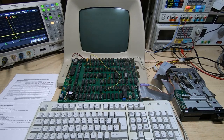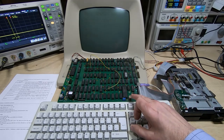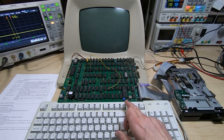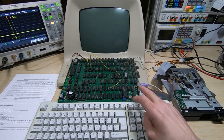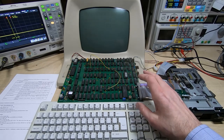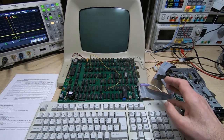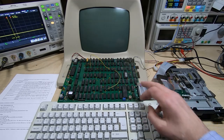Someone asked in the comments whether this could be modified to use 8-inch drives. You actually don't need to modify it - the controller I'm using will cater to either 5¼ or 8-inch drives. All you need to do is adjust the timing and pulse width to suit. The values chosen for the pot and variable capacitor do have the authority to adjust to whichever drive type you want. So this circuit can use 5¼-inch drives, either single or double density, single or double-sided, one to four drives, and also 8-inch drives. It's quite flexible.